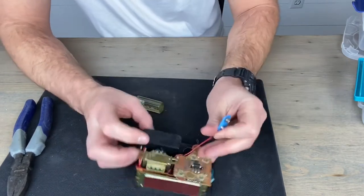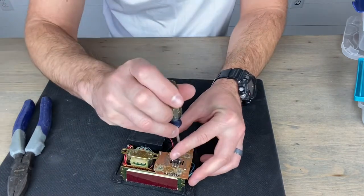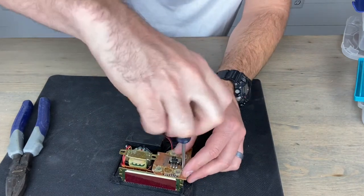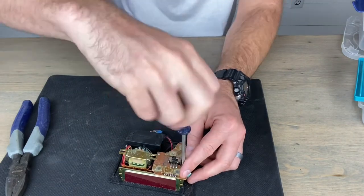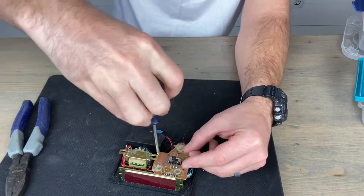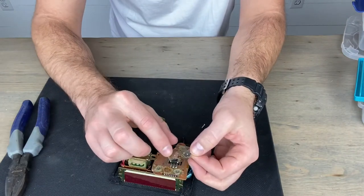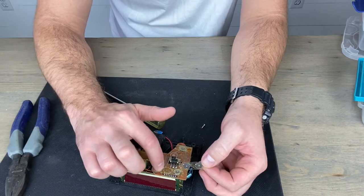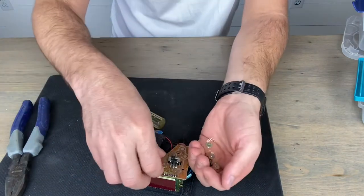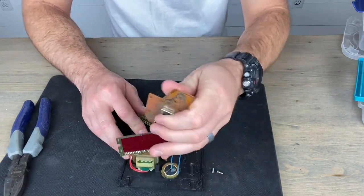On the back here is a battery compartment. I'll push that wire through so we can see everything from this side. Let's take these screws off this little circuit board, flip it over, and we'll be able to see what's on the other side — pretty much have the whole thing exposed in one shot. These little things I'm holding in my left hand are just the contacts — some type of aluminum or tin — where the button pushes down and completes the circuit on the circuit board. We'll peel each of these off and lift this board out.